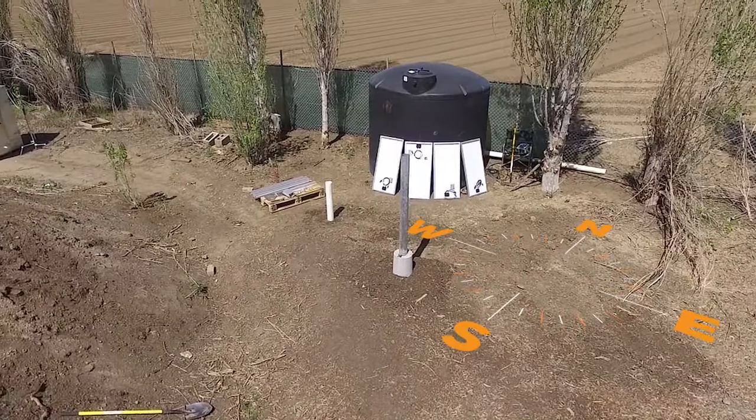In your splice kit, we also include new number markers — one, two, three. So when you make these connections, go walk to the end of your drop wire and put the markers on. I can't tell you how many times people think they can remember but then aren't sure when setting up the pump which wire is one, two, or three. While it's not the end of the world, at that point it's going to take troubleshooting and you might have to pull your pump up. So write it down, take a picture with your phone, or put your markers on your drop wire. I'm going to do this splicing process fairly quickly, but we have another YouTube video with a detailed step-by-step of how to do the wire splice if you want more instruction.